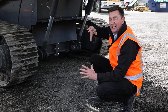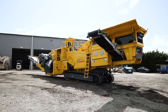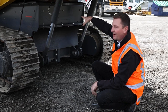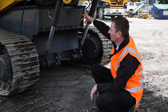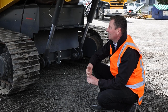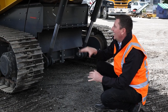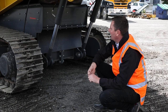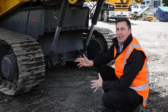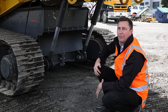As you can see, we've just been able to tilt the machine right up using these patented cylinders — part of the KeysTrack design. The three main benefits are: first, a vibrating discharge feeder with really easy access into the internals of the machine; second, you can tilt or slightly tilt the chassis for your production needs, changing the angle and shape of how the machine runs; and third, it's really handy for loading and unloading the machine off your transporter, giving you a good degree of angle change when driving up onto the transporter.